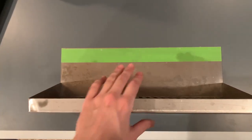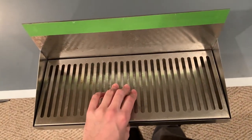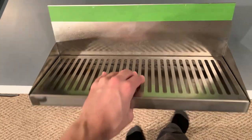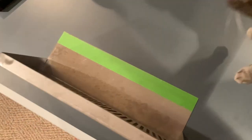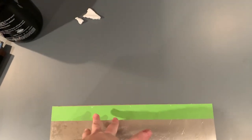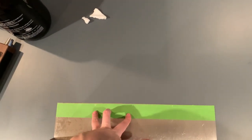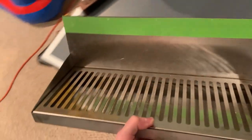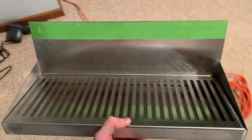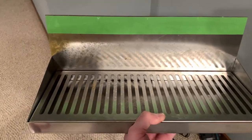While planning this, you also want to make sure you get a drip tray. This drip tray I bought is fairly large — around 16 inches wide. I found the center point and broke it up into four sections, so for three taps that's about four inches per section, and I marked where each tap should be directly above the drip tray. Use this in consideration when planning where taps need to be relative to the studs behind the wall.